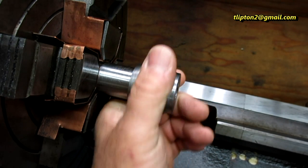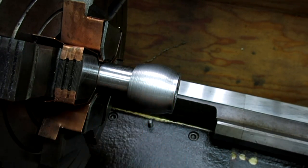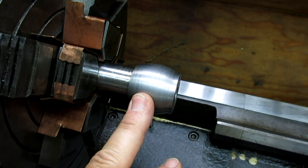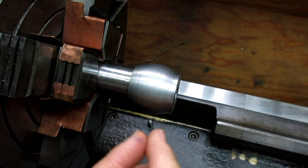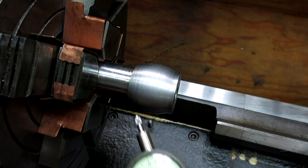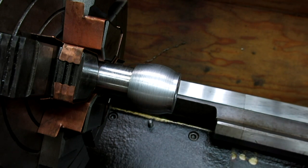We did our Tom Tracer deal here, and it stimulated a pretty good discussion which is always fun. I wanted to address some of those comments. A couple guys mentioned that I'm not following my template accurately because of the stylus diameter of the indicator. Basically, when the nose radius of the tool and the nose radius of the indicator are similar, it does pretty well.